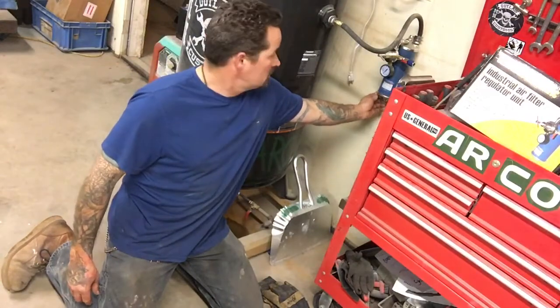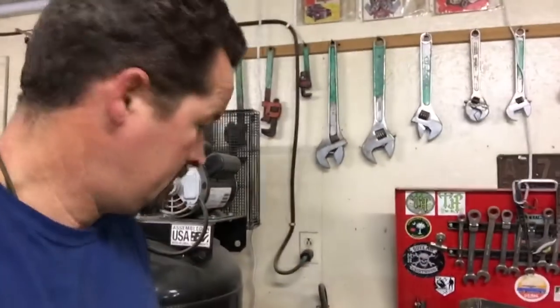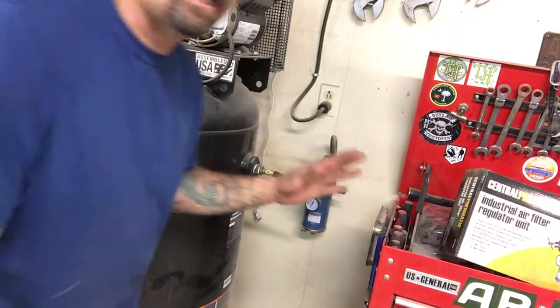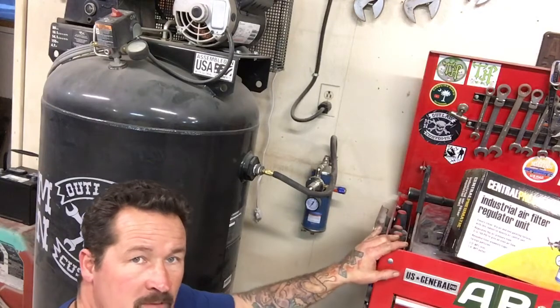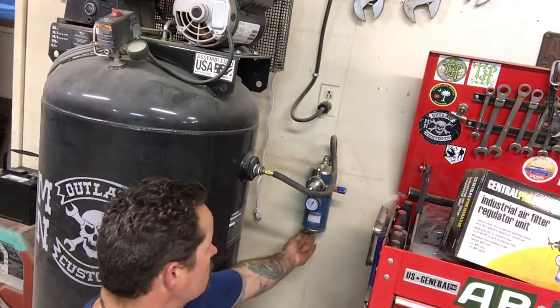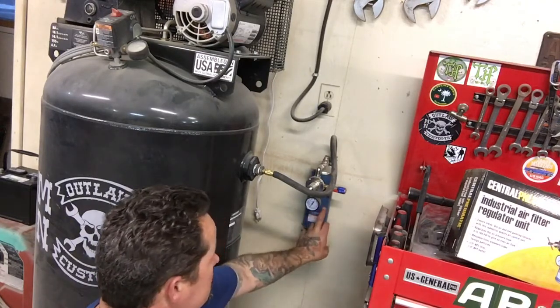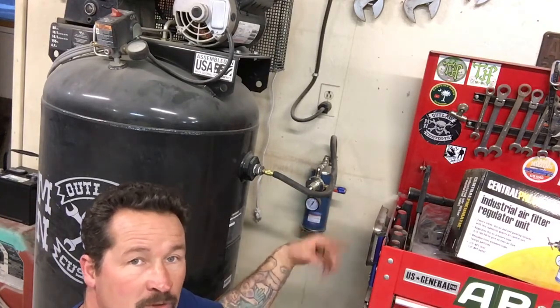You can unscrew that — I'm gonna move this tripod over so you can see a little bit better. If somebody's thinking about getting one of these from Harbor Freight, I highly recommend it. I've been using this for about two or three months now and it's really changed things — there's no more water coming out of the air lines. There's a drain on the bottom you can unscrew and it just pours out the water. This filter setup traps the water inside and won't let it go past the filter out into your air lines.